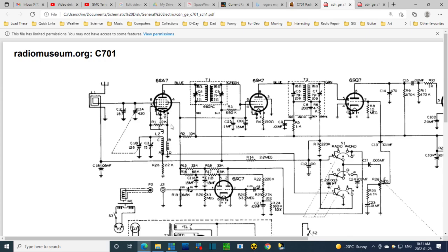If we're listening to 590, this oscillator is running 460 kHz above that. Those two frequencies are both in this tube affecting the tube current together — that's why they mix. You get four products: the two originals, the sum, and the difference. The difference frequency, if you tune in accordance with that, gives you a 460 kHz signal coming out, and it finds its way through. The other frequencies essentially see a short circuit here and are killed right in here.